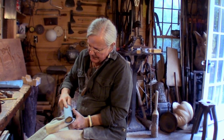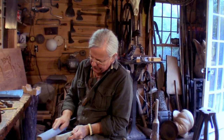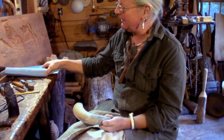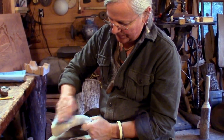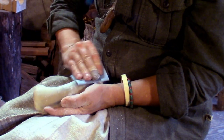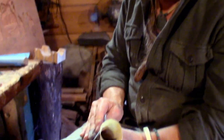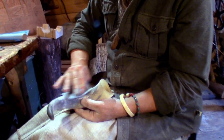What's nice about the magazine is, as opposed to say a wooden block, it's soft and it doesn't leave any corners or marks. It conforms to shapes better, and you get a nice smooth surface with no flats. I've done the 220 on the magazine roll, and now I'm sanding by hand. And when you do this, then you go with the grain, because with the magazine, you're cutting across the grain. Usually stop at 220, but the piece I happen to pick up here for this is 400 grit sandpaper, which is doing a fine job, be less work for the steel wool. So this is just about where I'm gonna stop sanding for now. We'll sand it some more later, I'm sure.